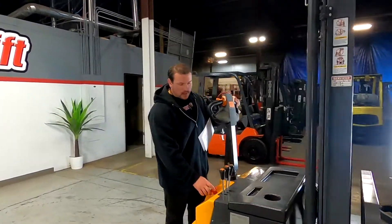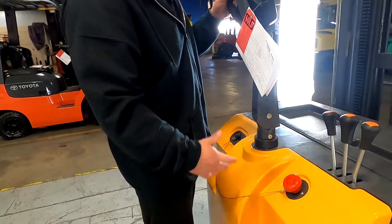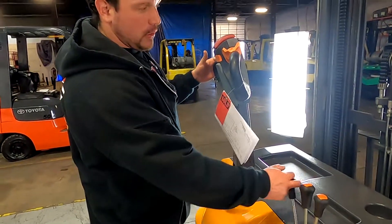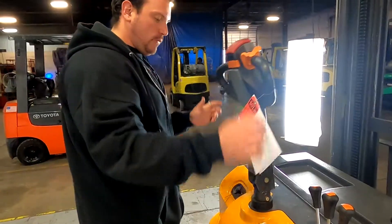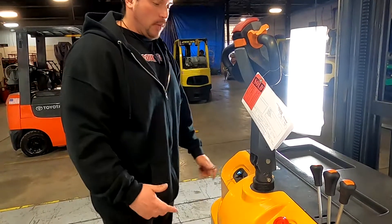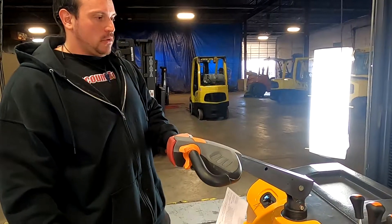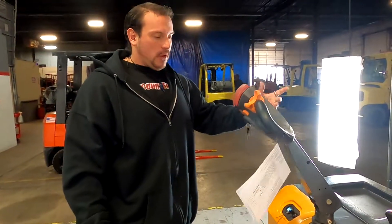One more thing I'm going to add is that you have your kill switch right here. So if you press down on it for whatever reason, just any kind of emergency, it'll actually disable the whole lift — you can't get the functions, you can't even tilt. Obviously it's not going to turn it off completely. When you pop it back on, it's actually going to go through the functions again and you'll be able to engage your controls just like you would normally. Everything works just like that.